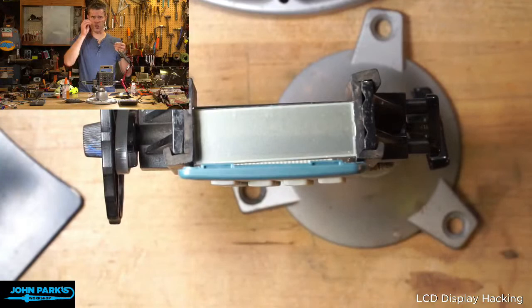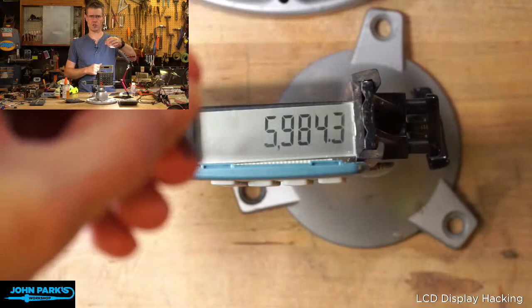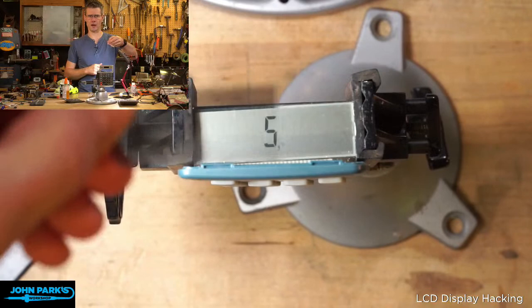So you can do secret displays if you had some sort of an LCD that you wanted to see, that no one else can see. Maybe you're doing calculations on the airplane and you don't want your nosy neighbor to look at them. Put the polarizing filter on your glasses, and in fact, you probably do it with your sunglasses. You might have to tilt funny, but I can see it, and so can you right there. Look how clear that is. So long as that light is polarized through the linear polarizer, you see the display.